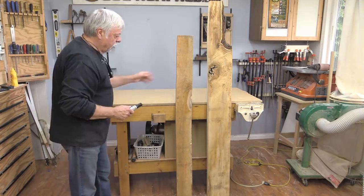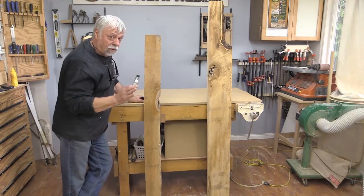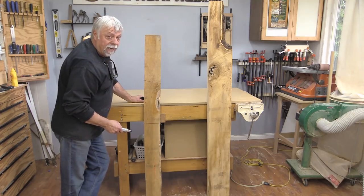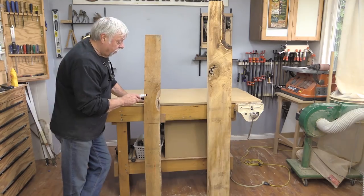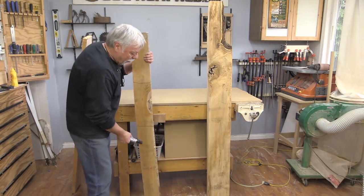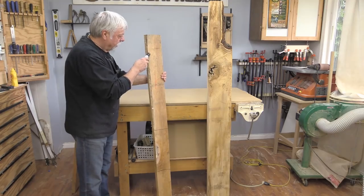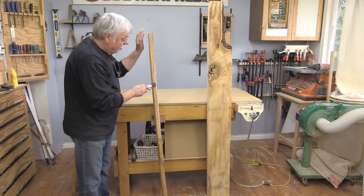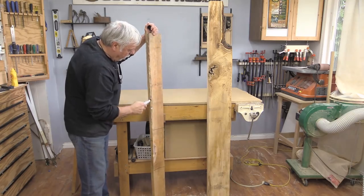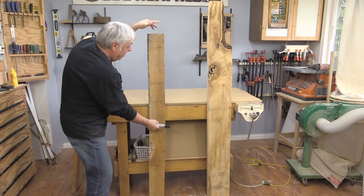This next board is very nasty. There's a big knot with all sorts of irregular grain - it goes every which way, it's going to be hard to finish and hard to sand. I would probably cut that board out right around that area and get rid of it. I probably wouldn't have brought that home if I'd had a choice. But when I flip it over, there's some chipping or bark missing here - that's a big defect. However, since it's a full width board, if I joint the back I can plane the front and joint off all that roughness, and I'll still get a very good straight flat board with some very good lumber in that area.